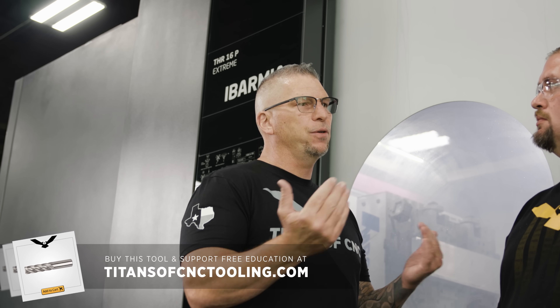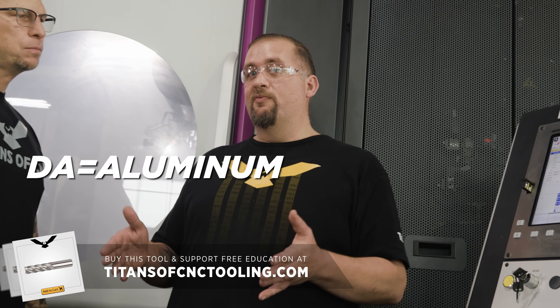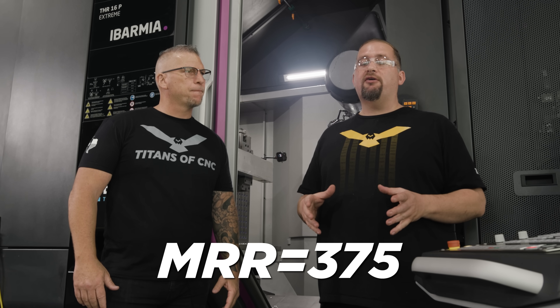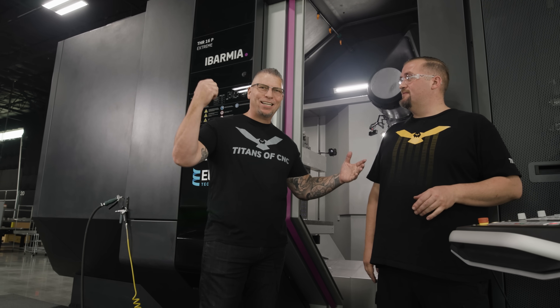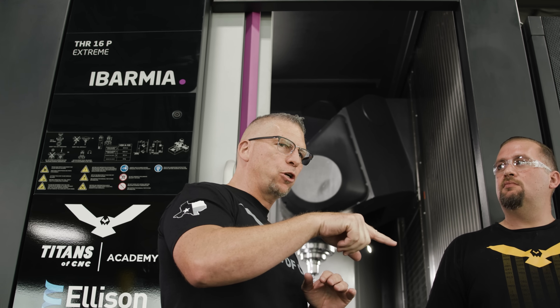The DA is for aluminum, the DS is for steel. We started with just one for aluminum, and now there's one for steel that absolutely gets after it. Now we're leaving our axial at three inches but increasing our radial to a quarter inch — that puts our MRR at 375 cubic inches per minute. We're dropping some Synergy 735 coolant on there to take this incredible cut at 500 inches per minute.